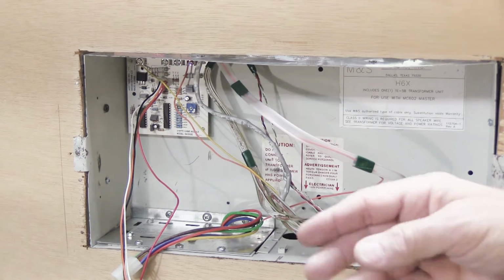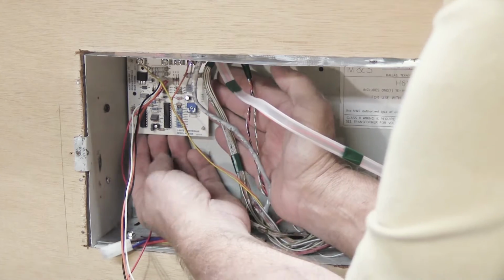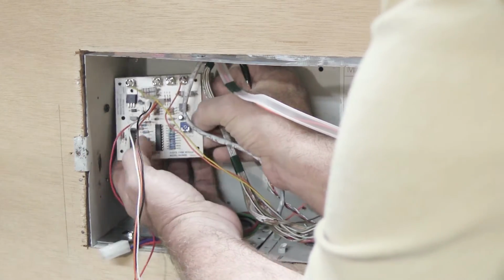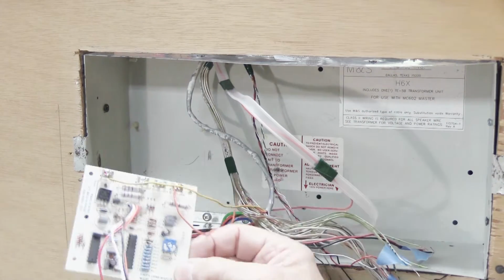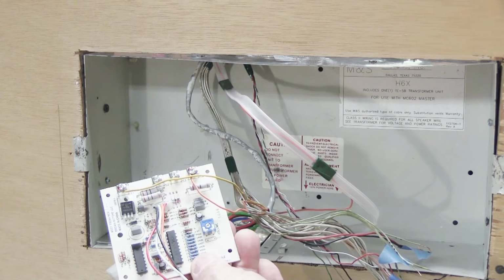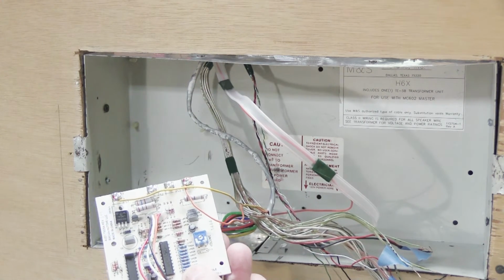And what you have to do to remove it is you sort of reach in there with your fingers and put them behind the chime module a little bit, and you wiggle and you pull it forward and it comes out. Just like that. See, that was easy. Different chime modules, there are 2 different kinds. This is a 3-note chime module. Sometimes you'll have an 8-note chime module.